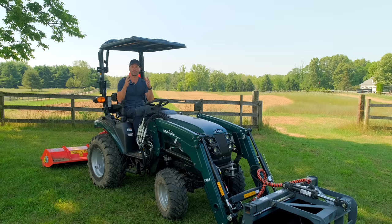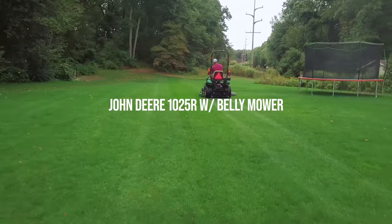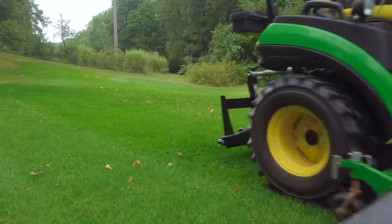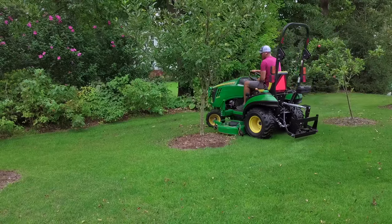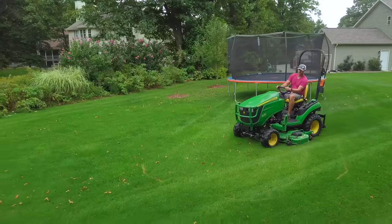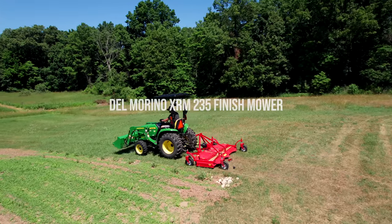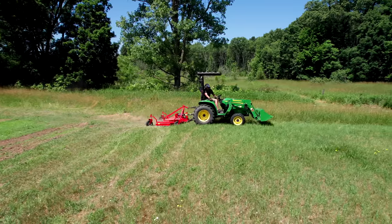Let's start with the obvious — let's talk about mowers. There's a lot of different mowers out there. Belly mowers, finish mowers on the three-point, even flail mowers. A belly mower does a fantastic job mowing your lawn. The trade-off for a lot of folks is not wanting to take the belly mower on and off to tackle other projects with your loader or your backhoe. You really shouldn't leave a belly mower on there — they don't raise up very high and can often be in the way. The three-point finish mower just hooks up to your three-point hitch and rear PTO, so those are typically easier to take on and off when you don't need it.